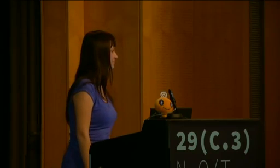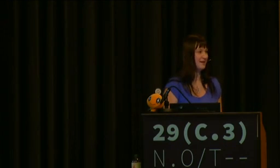Okay, and now to the left, please. Yeah, that's left. Well, first of all, about the test program, I've hacked a few Sunplus, GeneralPlus chips myself. Don't be too hopeful. Secondly, most embedded system-on-a-chip devices like this have a debugging port, which is usually a basic serial port. You have a TXD and an RXD pin. And if you're lucky and the developers actually left the debugging code in there, you can just hook a serial bus to it and then just read whatever the Tamagotchi is thinking. Have you tried that? Unfortunately, I've looked quite hard for that type of functionality, and I haven't found any.